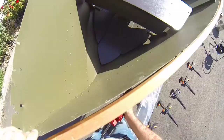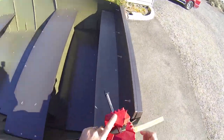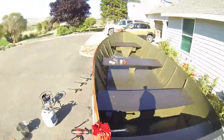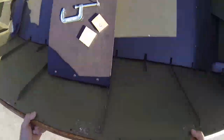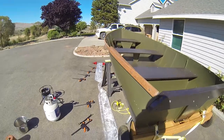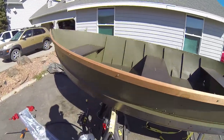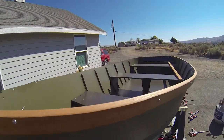It wasn't holding that much shape on its own, so I very quickly took it out of the bag and put it right back on the boat — I didn't want it to dry out in the wrong shape. I put the two end clamps back on first, then carefully made sure that the quarter-inch mark I'd made all the way down the wood was right on top of the metal. I wanted a little bit of wood above the metal so there was no sharp edge sticking out and the metal stays completely hidden all the way around. Once aligned, I put a few clamps back in, drilled some holes, and tacked it with preliminary bolts. There it is — out of the bag, a few bolts, right shape, right contour, bent all the way up to the front.